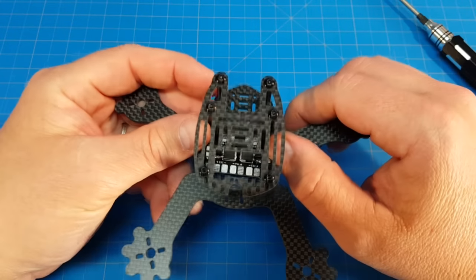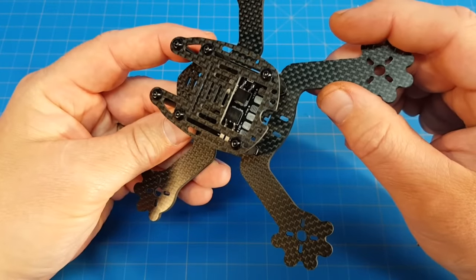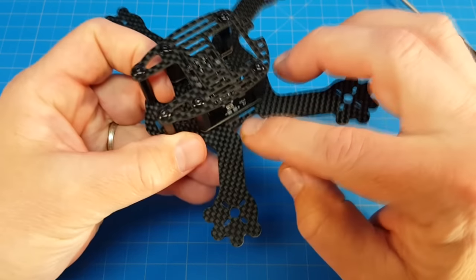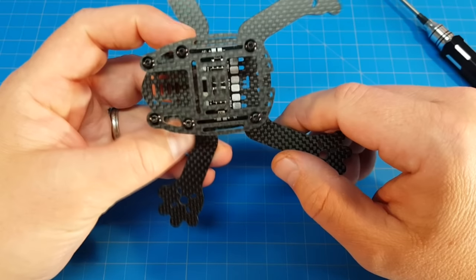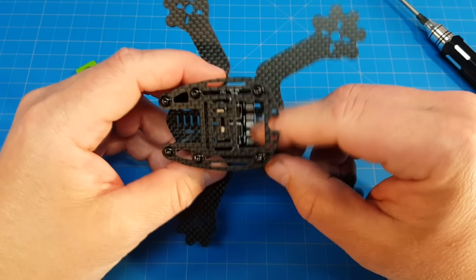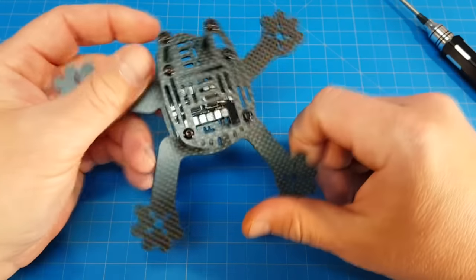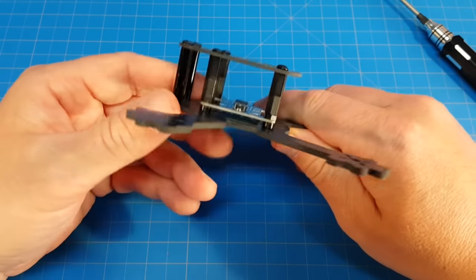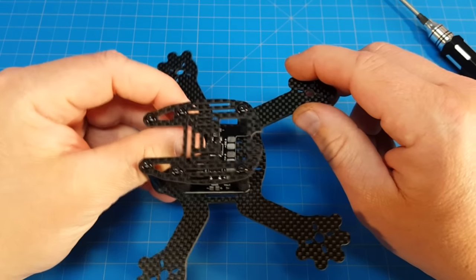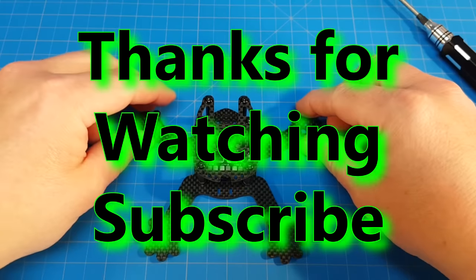This PDB is just a mini Diatone - I can link that one. It does have a 5 volt side and a 12 volt side, so I could power my camera and VTX off the PDB if needed. Next up I will be doing a build video on this, and then we'll have the exciting time of taking it for a flight. Like and subscribe and we'll see you guys later.